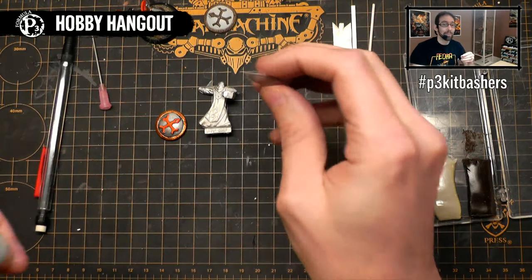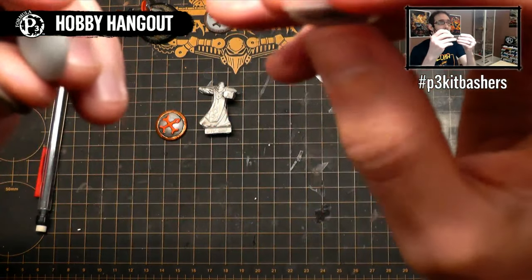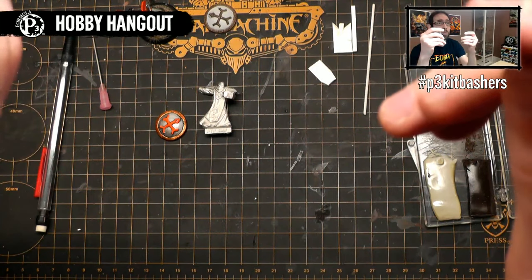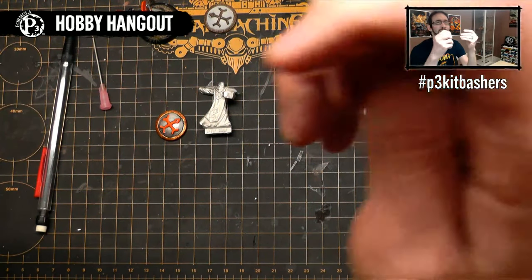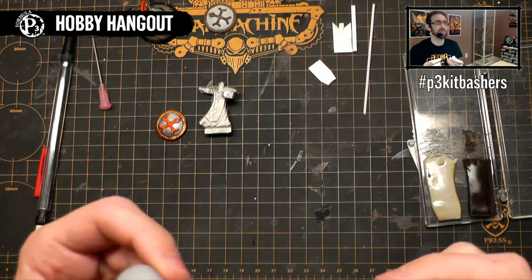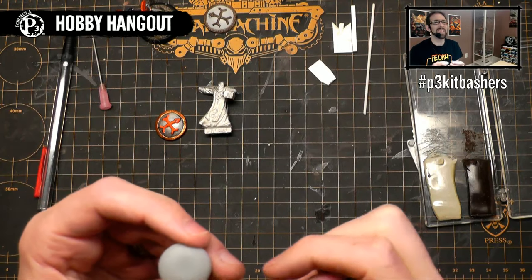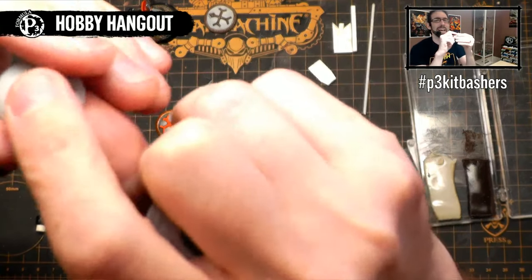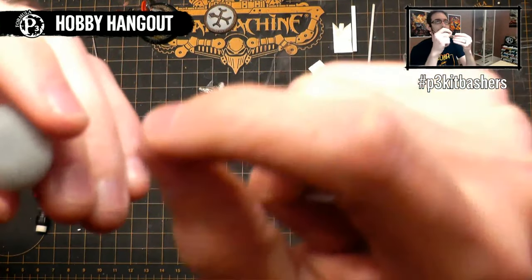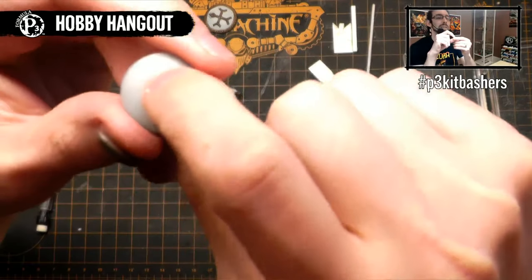Right. Now you don't have to use resin for any of this kind of stuff. What you could use is a little bit of putty if you want. I've seen people use grout, plaster. It doesn't really matter what you're using, though plaster is not great because it's super brittle. The normal super glue doesn't like to stick to plaster. No, it doesn't, super well. But it kind of absorbs in, right? Yeah, it's not super important because the master only has to survive long enough to make that initial casting. You're not really using it for anything else.